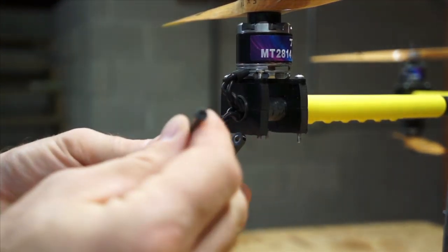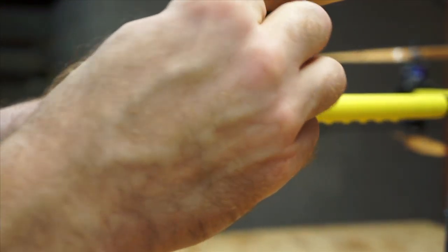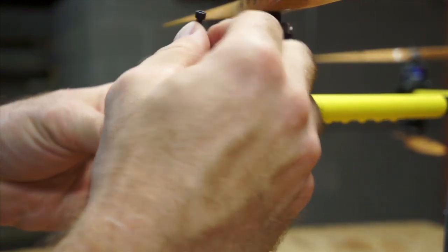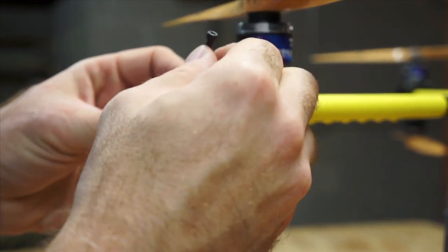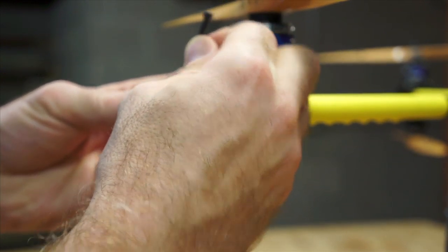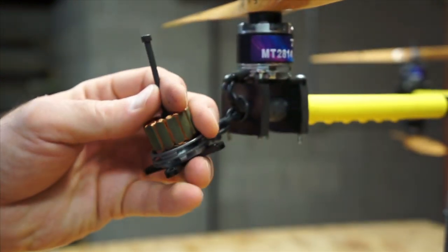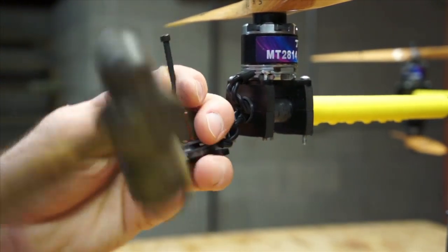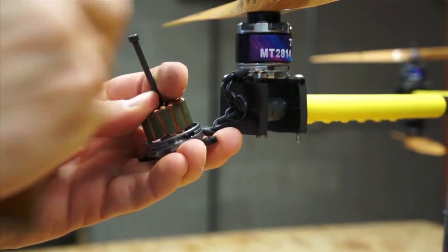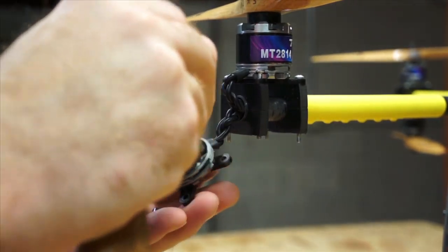Here's what I do. I start with my 6-32 bolt and put it in on a little bit of an angle so it's pushing down on the side of the bearing on the other side. I don't want to just keep tapping it on an angle — I want to tap it a couple of times, then do the other side, rotating around. I don't want the bearing to get cranked in that little seat because that'll damage the seat. I just give it a couple taps and it comes out very easily.